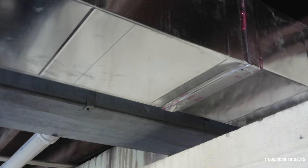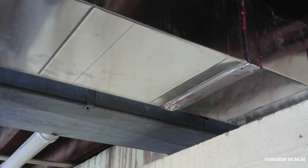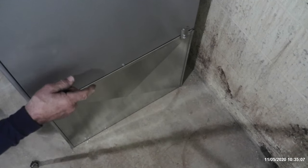So now that you've got that established, you're probably going to want to move the furnace out of the way to cut the hole. So what I do, just because I'm lazy, is I'll mark the furnace on the floor. By marking that, that's going to give me a reference point when I move the furnace out of the way to cut the hole in the bottom of the duct and then slide it back in. It doesn't mean it's got to hit exactly, but at least it's going to be fairly close without measuring.